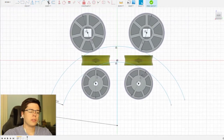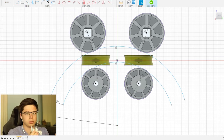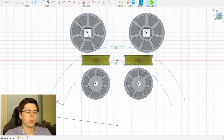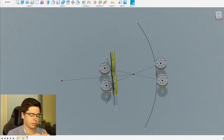Through trial and error I found that around 20 millimeters it is just enough that it does not overlap with the inner curve of the wheel. So 20 millimeters is obviously really tight. The bogeys do not represent the actual limitations of the train, because the arc is going to be different across all four bogeys as opposed to just a single one — which involves more geometry. For the yaw axis it's the same exact process. Because I have a fixed width between the bogeys, I can find what the limitation is for the yaw axis as well.